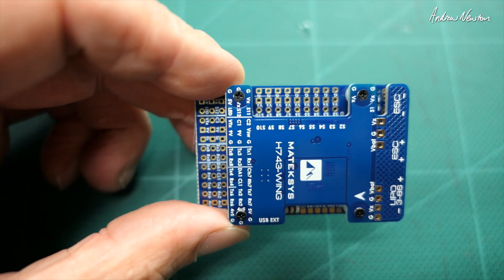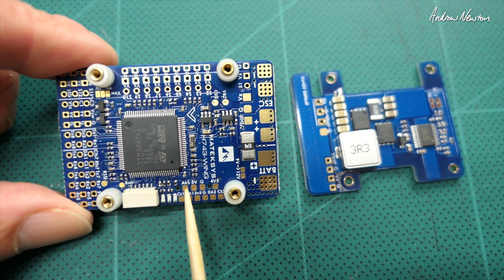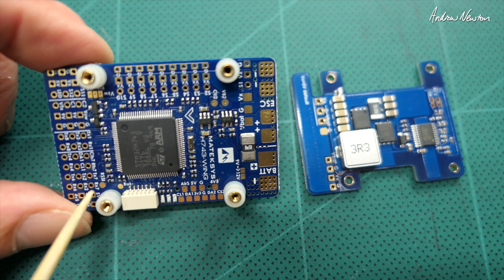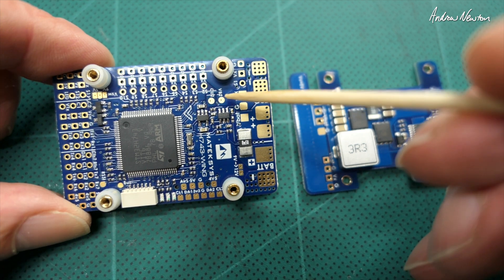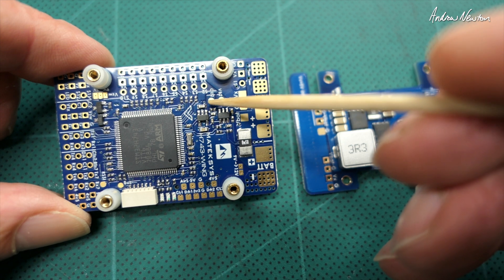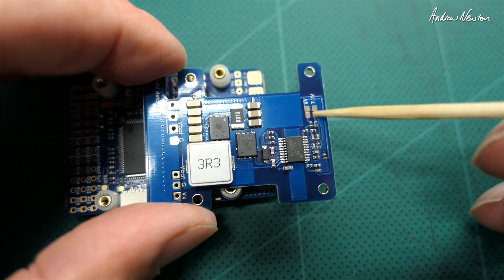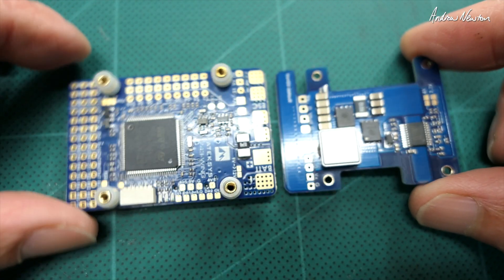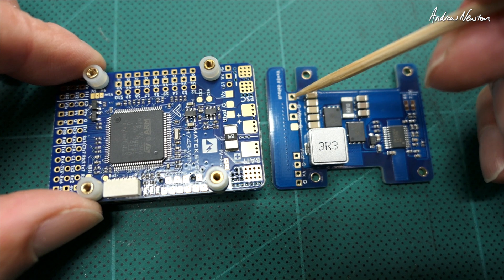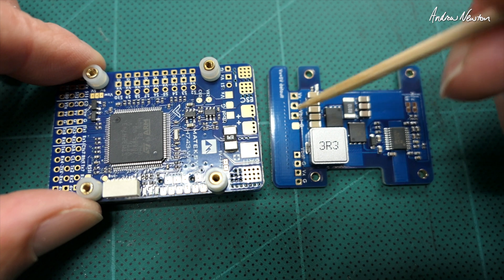Let's take the top deck off and have a look underneath. We can see it a bit clearer with the top deck off. There's the airspeed sensor port, RSSI is over here, here are the solder bridges for the camera 2 switching voltage, and here's VBAT2 and current 2. On the underside of the top deck, this is where you choose the servo voltage — 6 volts, 7 volts, or leave it alone for 5 volts. And here's where we connect the top deck to the middle deck: VX to VX, ground to ground, and VBAT to VBAT.